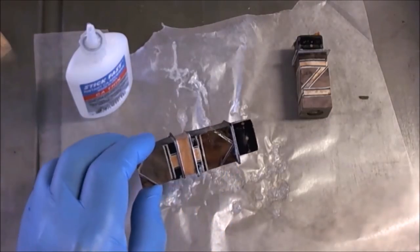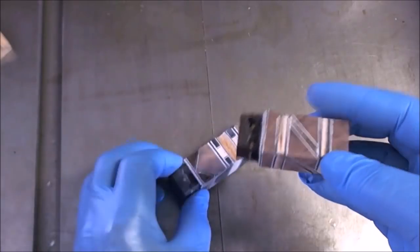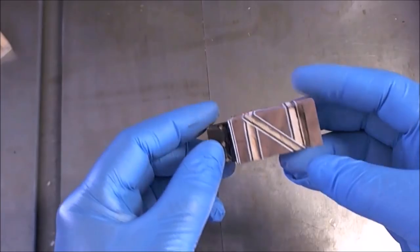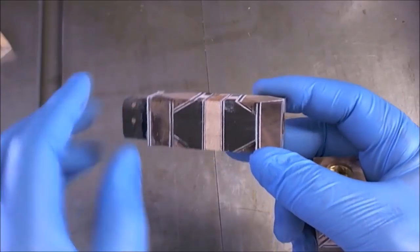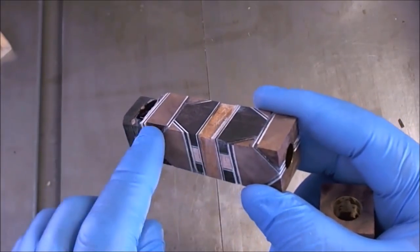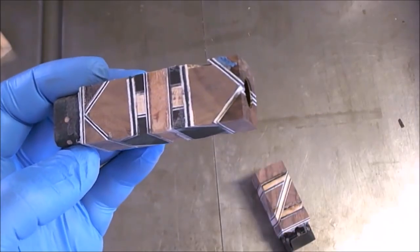The disc sander next. So just like before on the disc sander, I just sanded these, all the veneers off to make those look good. And you can see this one here. Now I just want to do one more thing. I'm going to relieve the edges of these corners so that when I start to turn it doesn't catch and break away anything. So we'll do that on the disc sander also.